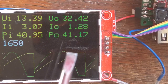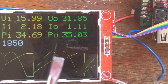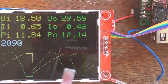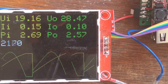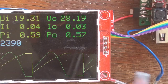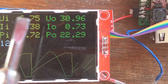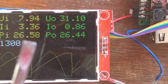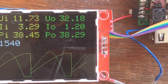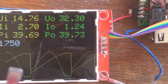The power rises and the voltage is also pushed upwards. Then at about 15 volts, the power decreases and we are going to the open voltage. Here the current and power go down to zero. Now we've cycled back to the beginning — we have short-circuit current at really no voltage, then the DAC drives the input voltage upwards and we get the curve again.